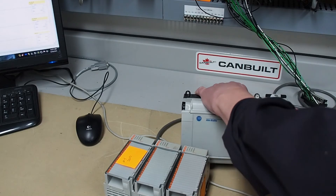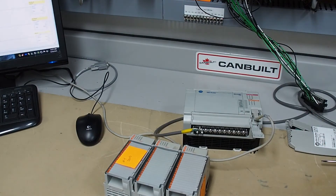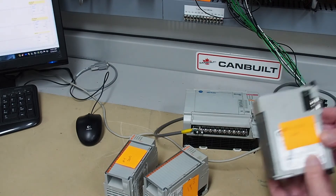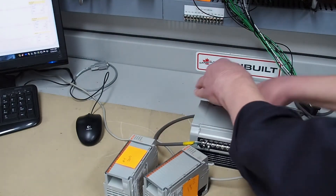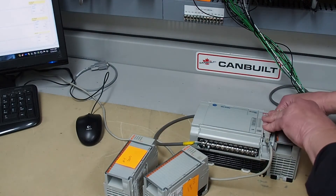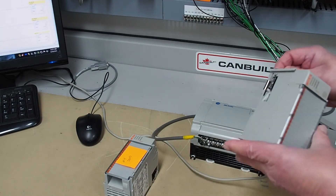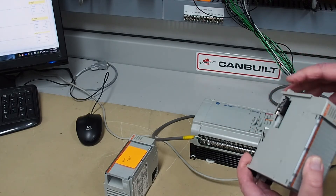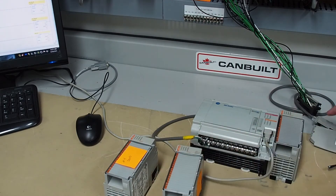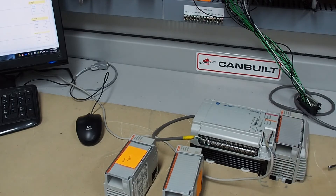You unlock the end cap and it slides off. Move the locking lever over and take it off gently. That one we know is good. This one, when I tested it before, has relays three, four, and five dead. Slide it on — if this was mounted on a panel it would be in there tight. Make sure the locking lever is over, because when you move it, it connects to the bus in here, which is power and communication. Move it back and it's off. You have to put the end cap back on; if you don't, the processor will fault and not run.